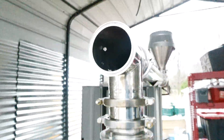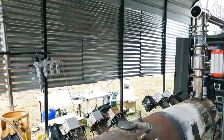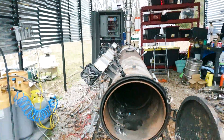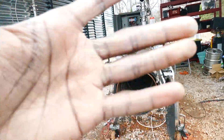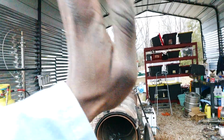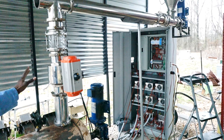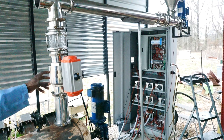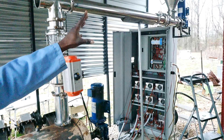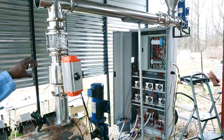I've been so busy doing this. I'm sorry it's been like two months since the machine has operated, but this upgrade is worthwhile because this will change the game not only in how much plastic we can process a day, but how much fuel can be made per run. The efficiency of everything is just going to be brilliant. I have successfully plumbed in this first ball valve here, and this is going to be the ball valve through which plastic loaded in at the top will feed and fall down into the machine.